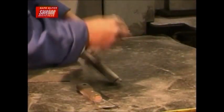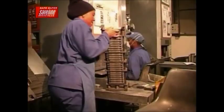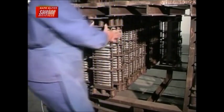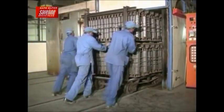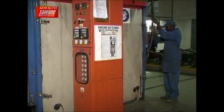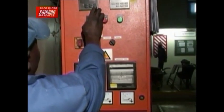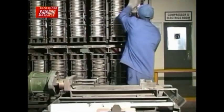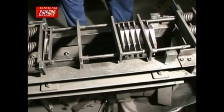Following this process, the pads are cleaned and set in oven clamps at a predetermined pressure to ensure compound density, which is checked at all times. The curing process is next, with approximately 4,500 brake pads being cured at a time for about 8 hours in a computer-controlled batch oven. A dual graph readout is used to ensure the curing temperature requirements have been met. After curing, they are then put into a clamp release mechanism to remove them from the oven clamps.